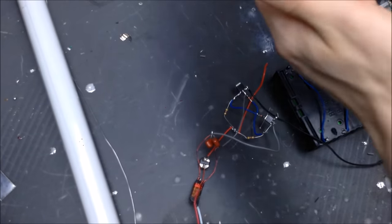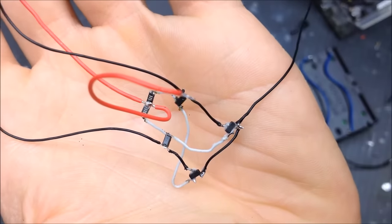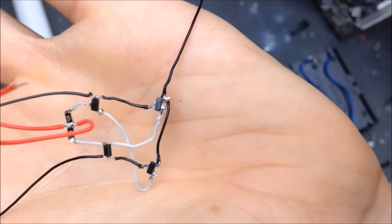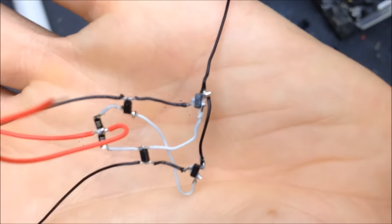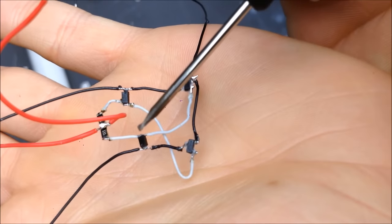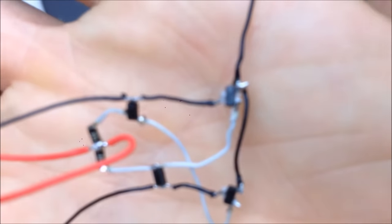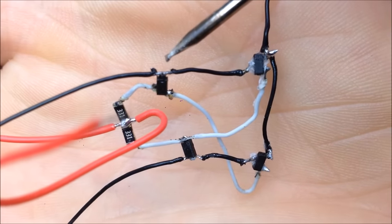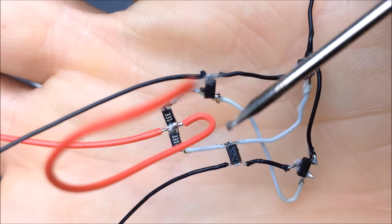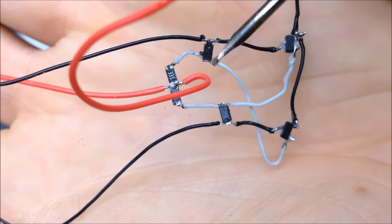I've got something here to show you as well. So right here, see if I can focus it. All right, so right here I have a mini ZVS made of little MOSFETs. I've got the two little MOSFETs on the bottom. So let's find out what I have here. These are two 24 volt, 2 amp N-channel MOSFETs that are surface mount. I've got the two surface mount diodes in the configuration, so if you can kind of see there. I've got the line side here, and you've got the line side here, so cathode, and in the center, anode. And I've got my two 330 ohm resistors.